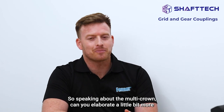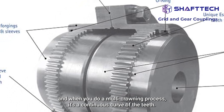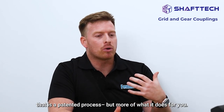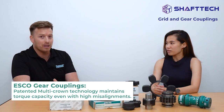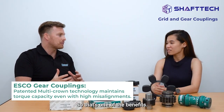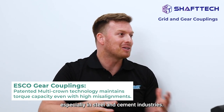Can you elaborate a bit more about how multi crowning works? Multi crowning is a process where in a gear coupling you have a gear tooth, and the multi crowning process creates a continuous curve of the tooth. Without going too deep into the patented process, what it does for you is this: a number of gear coupling brands do a version of multi crowning, but ESCO is unique in that when you have full misalignment, you can still transmit the full torque capacity of the coupling. Some competitors, as soon as you get to an extended range of misalignment, require you to reduce the torque capacity. So the benefit is that even at full misalignment, the coupling still delivers full torque, helping it survive strange circumstances especially in steel and cement applications.